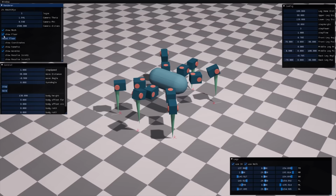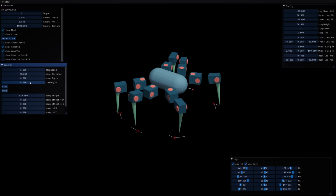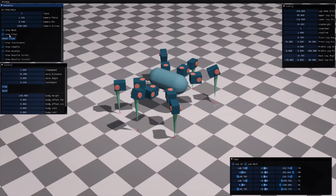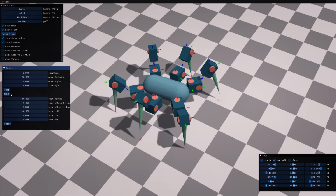For moving in a straight line, you want to follow a vector in that direction. And to rotate, you want to move in concentric circles around the center point. Combining the two was a little bit tricky. I had a small problem that the home position started to drift when I added those two vectors. So I made the first part of the step the same as the last part of the previous step. Basically, return home first and then start a new step. I doubt an insect walks this way, but that was a quick fix for now.